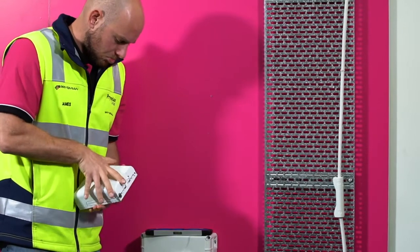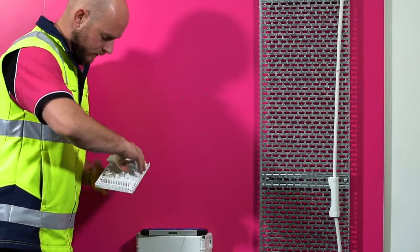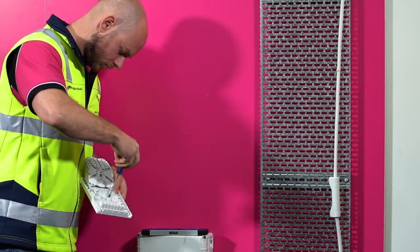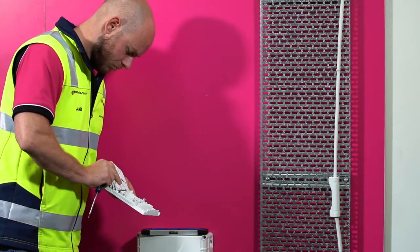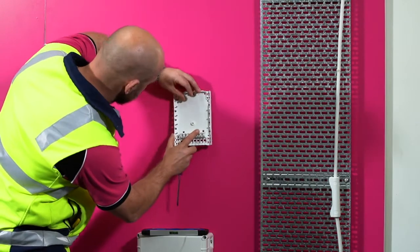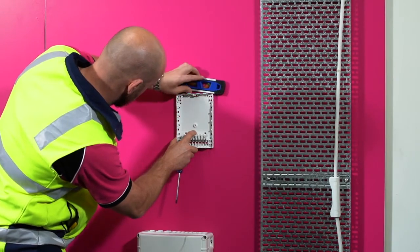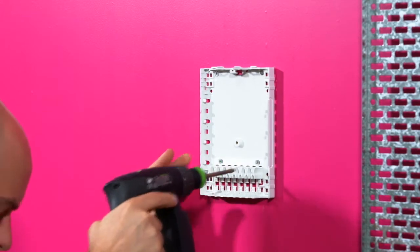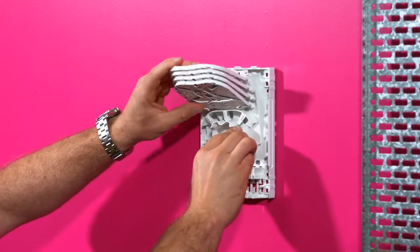Now it is time to mount the RBMT. Begin by opening the lid. Some of the mounting holes are covered by the tray module, so unscrew the tray manifold and remove it. Place the RBMT in its position, mark the drill positions and fix later, or mount the unit straight away. Screw the tray manifold back on, choosing the appropriate side.